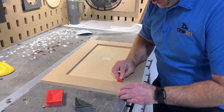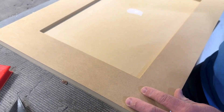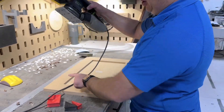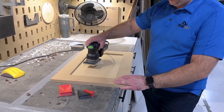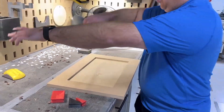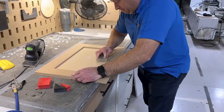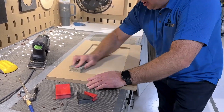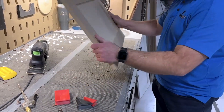Sometimes these ones aren't bad, but sometimes we'll take this, and especially if there's like a beveled — instead of this square shaker — we can get a little piece that the router didn't get out. Then what we'll do is grab our sander. We use the Festool. One of the things we've found is we never want to go back and forth this way. We always want to go the long way if possible, because it leaves lines if we don't. Then we grab our hand sponge. That gets our shaker edge, and then we kind of go back and forth like this. Our panel's done.